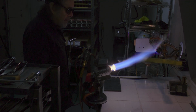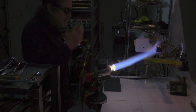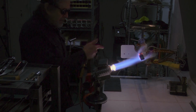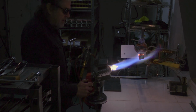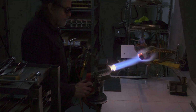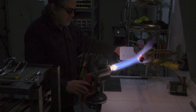compressed air wide open. My oxygen system is a low pressure tank, 175 psi low pressure tank, in combination with 2,000 psi high pressure tanks. They're connected together with a check valve system, and so it gives me the ability to rage like this for a short time, which could never be supported even slightly by the 3 5-liter per minute oxycons. But because I have the high pressure backup to handle this extreme requirement, I can actually get the best of both worlds out of this system. Of course, I can't do this for very long, but I don't believe I need to do it for very long.